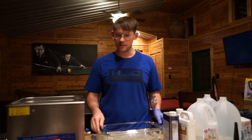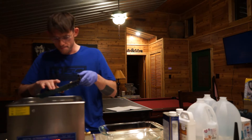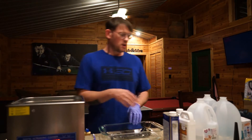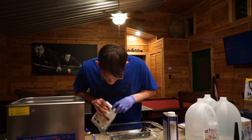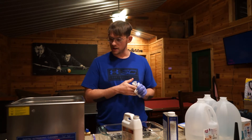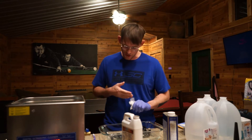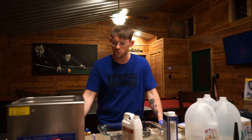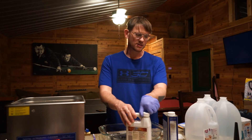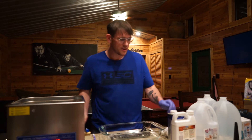I just finished the process with the baking tin. A couple of important notes: I used Windex one-fourth solution and another miner had done a full Windex wash. But it wasn't even getting the paste off — I went to touch it and it was getting hardened. So if you use Windex, make sure to take the paste off first. And honestly, after doing this the first time with Windex, I just recommend you guys get some Elma Tech or something like that — an actual PCB cleaner — it's just going to work better.